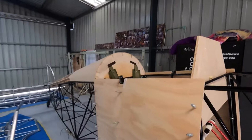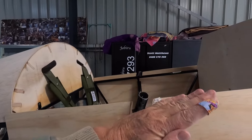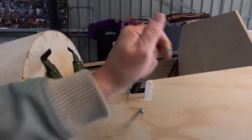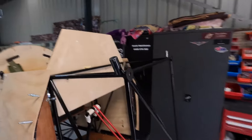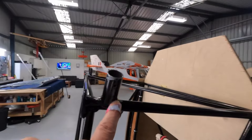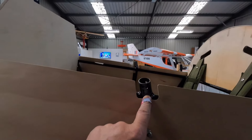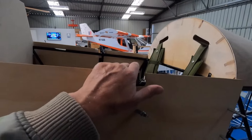If you remember back in the kit, those little stubby tubes are way off with the direction — in both fore and aft angle and inboard outboard. Other guys have heated them up and welded them. With the kit, they should be spot on or within plus or minus 10 mil, but they're out by quite a way. I've got all my holes on centre — I already knew that because I drilled the hole first, as you can see in the other videos.